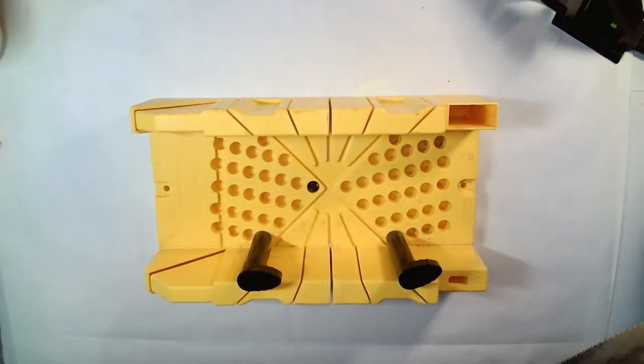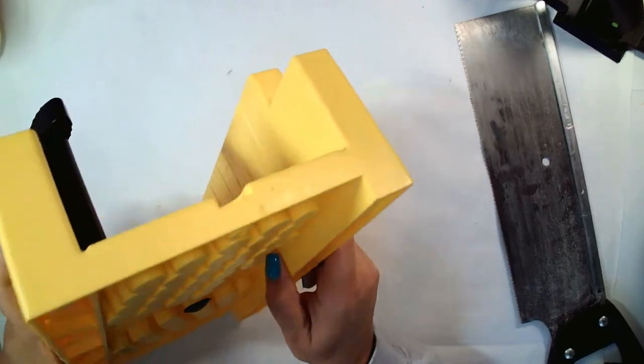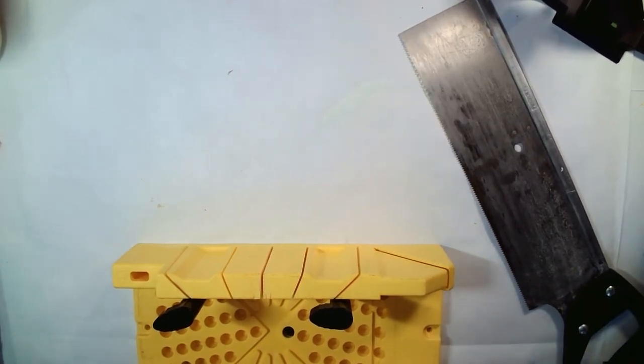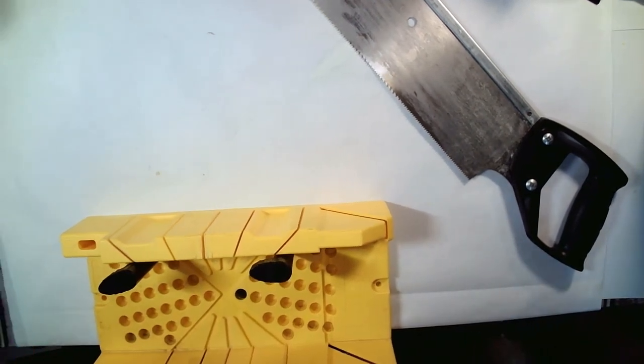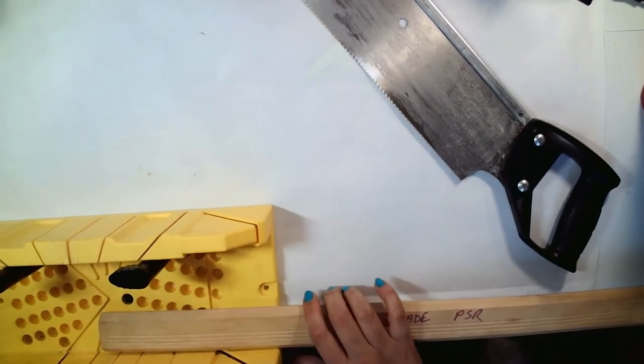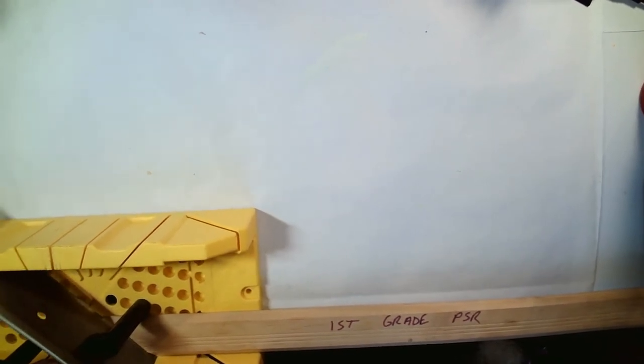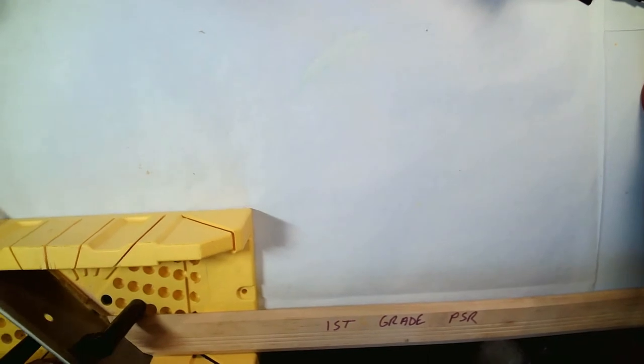Now I'm going to use my miter box — and if you don't have one of these, this is the best one I've found, it's by Stanley. It has this little lip so you can hook it onto the edge of your table, and it has two black pegs that help hold the piece you're cutting into the box. I'm using this piece of molding left over from something we'd done at church. It has marked on it the 45-degree angles, and I'm making a frame for that calendar page — so 45 degrees is what I want. I'm not going to speed this up just so you can see how long it takes — I'd say it was under 30 seconds to cut through this molding, and I'm not even pressing that hard.